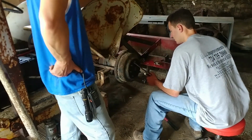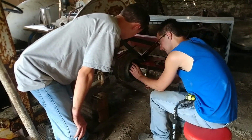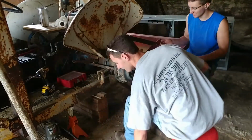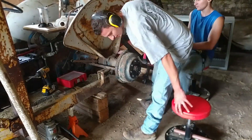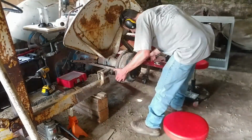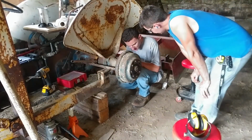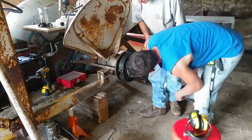On the 4th one, I sprayed some penetrating oil, and we couldn't get it out by hand, so my brother got his impact driver and filed down a spade bit on it, because those are 1/4-inch drive also. He went forward and reverse a couple times, on second speed on his impact, and he was finally able to get that last screw out.